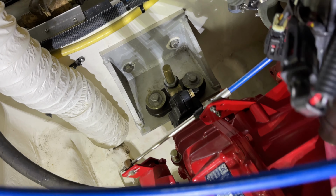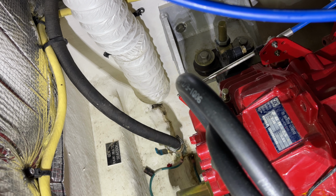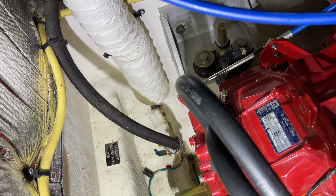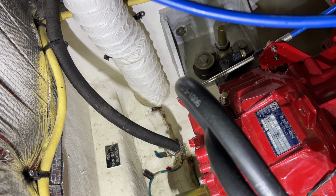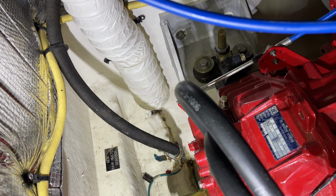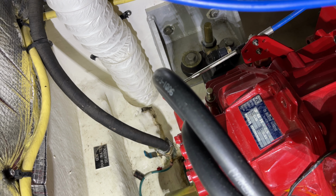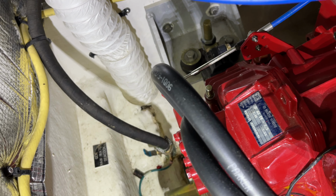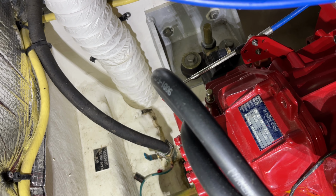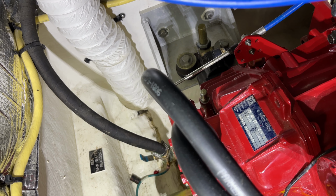As I was extracting the oil, I was also thinking that we got a mechanical survey inspection done on the motors and the generator before we purchased, and that was part of the agreement. We sent samples out for the generator: engine oil and coolant. For the engines and the transmissions, we sent out engine oil, coolant, and transmission fluid. The report that came back for the transmission fluid said there was a lot of particulate inside the transmission. That pretty much indicated a lot of friction material floating around inside the transmission oil. There was no metal filing, no findings of that. It was strictly particulate. So the recommendation from the lab was to do a complete service. That's the reason why we're doing that.